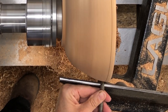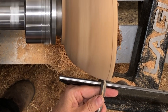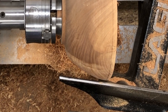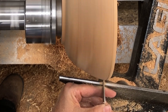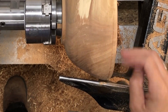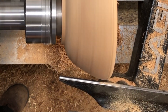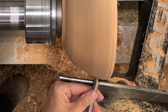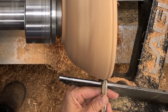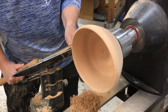At this point I decided that since I had enough thickness, I wanted to add just a little bit of a detail to the top rim of this bowl. It's a pretty piece of wood — there's a little bit of spalting and some interesting figure — but apple is a little plain, and I thought a little bit of a bead on the top rim might be kind of nice. Of course then I have to go back and blend it in.